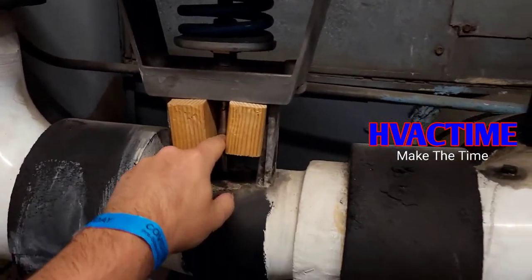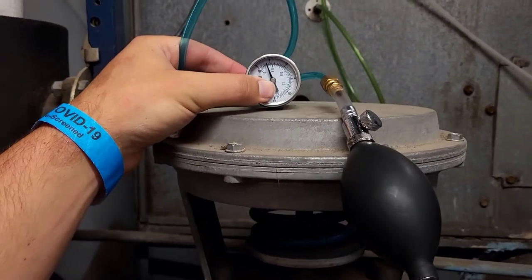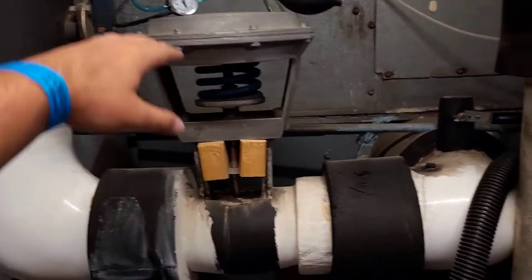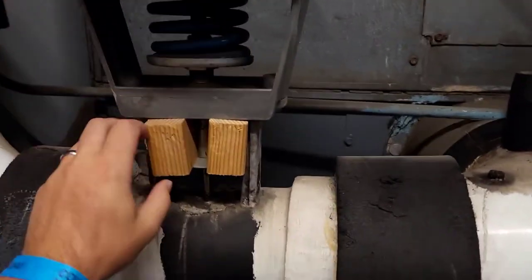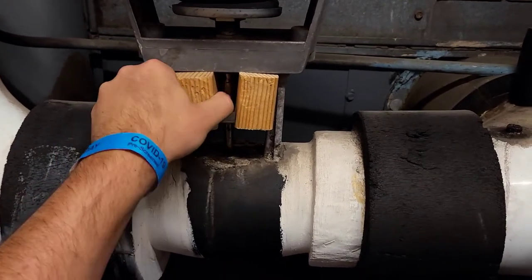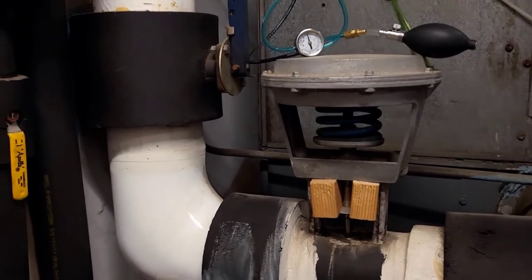This chillwater actuator is not activating. It's a pneumatic actuator with basically no pressure coming to it. It does have a tag on the other side that should give the actuation pressure range, but regardless, I'm not seeing any pressure here. They did do a temporary block open here just to get some kind of flow on it, so we need to go look at the main control panel and see what readings they have and do some testing with the pressures.